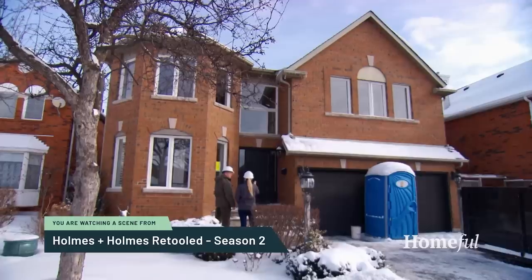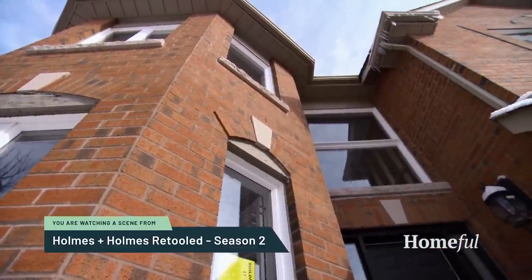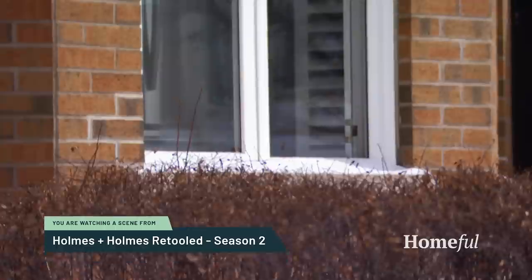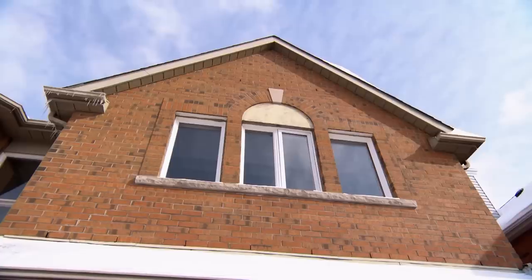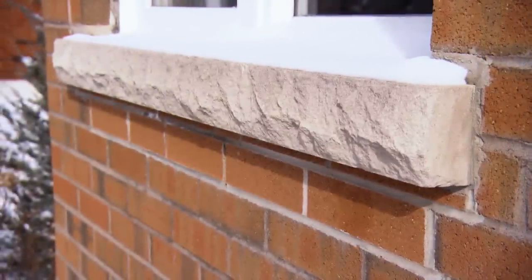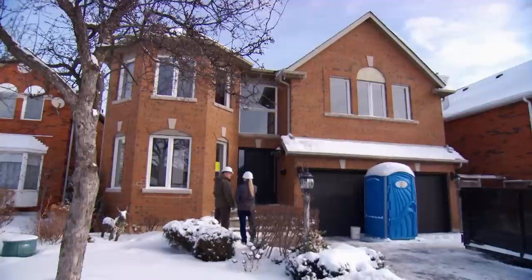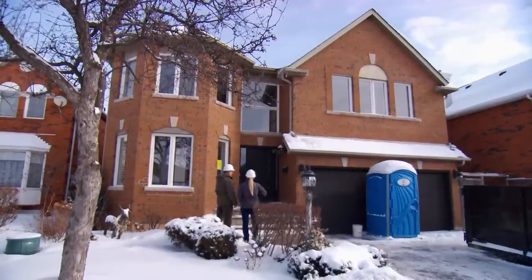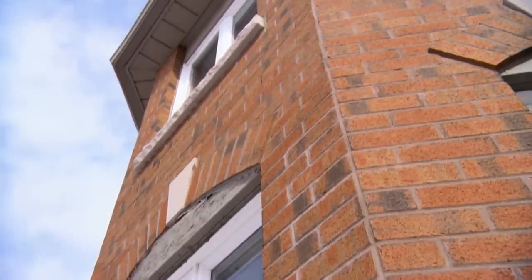I meet with Kristen to discuss my plan to stain the exterior brick. Not many people know you can stain brick, which is actually different from painting it. When you paint brick it coats the surface and eventually moisture gets in — it'll peel and flake. Staining brick is a different process — it's designed to actually sink right into the brick where it literally crystallizes, allowing the brick to continue to breathe. By never trapping moisture, it's never going to crack and peel and fail like paint would.